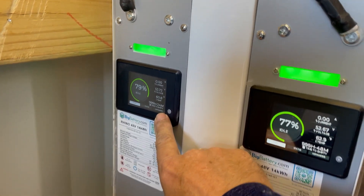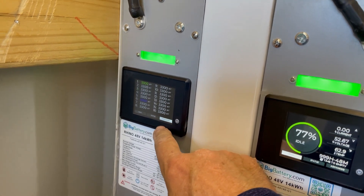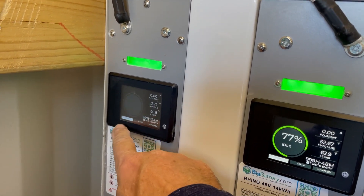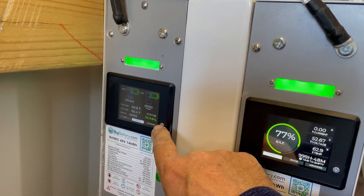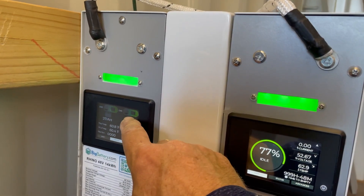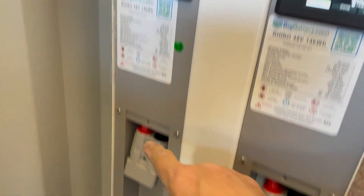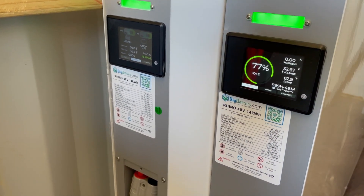I really like this little touchscreen computer display — I can touch Status to see how many amp hours are left, get the advanced screen showing voltages of each battery cell inside the 16S configuration, and on the main screen I can actually turn the discharging circuit on or off and the charging circuit on or off. Discharging off means the battery goes off and there's no voltage output, which is kind of nice. All the voltages are close enough together, so I'm going to plug them in and get started charging.